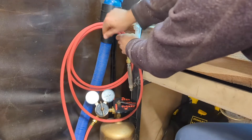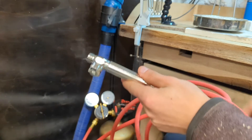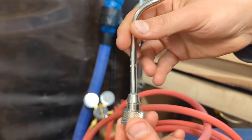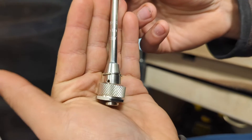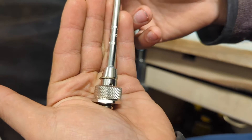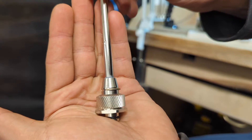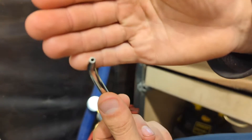So we're going to get this set up. I'm first going to take this Velcro off so we can take the hose down. This is the torch handle, and we're going to take one of the tips. When we take the tips, we can see there's some writing on the side here — we can make out this number, and it ends in dash-0. So that's the size of the tip. This is a size 0 tip.